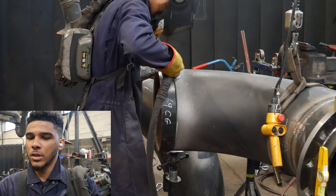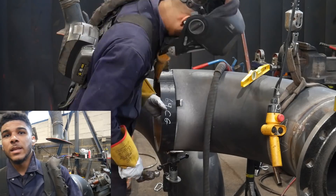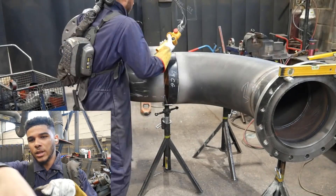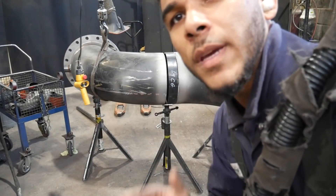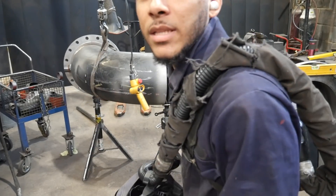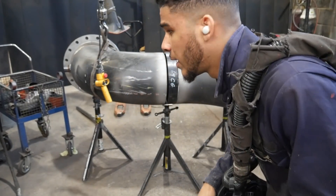I'm going to weld two sliver welds at once — it shouldn't pull this big pipe, though I tend not to do that. The issue is I don't have a helper and these things are too heavy to pick up on my own. I do have a crane but it only moves in one orientation — not backwards or forwards. Times like this I wish I had V-stands with wheels, because then I could just position it easily and it would save me time and possibly avoid injury.